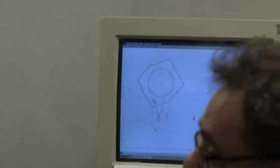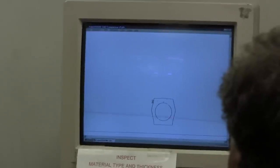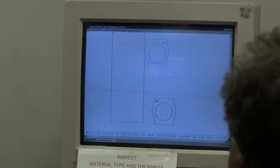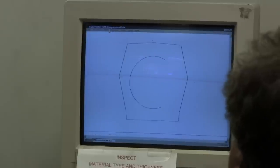Once I compare it to two files — you merge the program with the part and it tells you if there's a variance. The lighter blues indicate everything is within tolerance. These little red specks along the outside edges are actually specks of dirt on the glass, or if it was close to the edge it would be curved and would be checked out. That gives us a quick visual that it's a good part — we can go ahead and punch the rest of them.